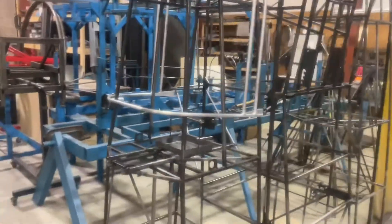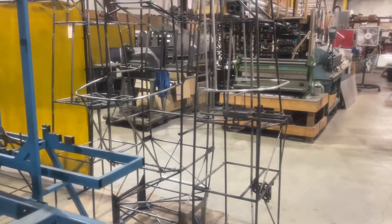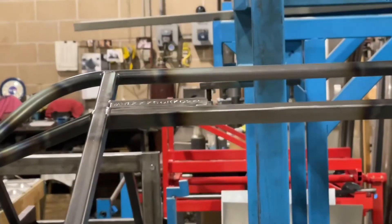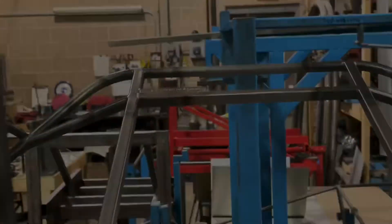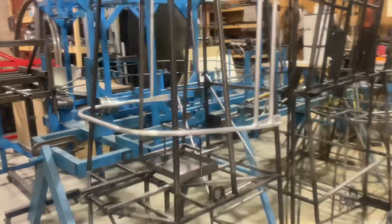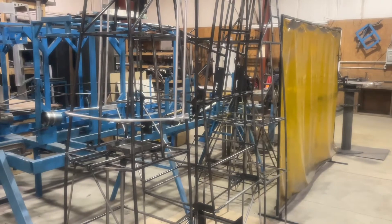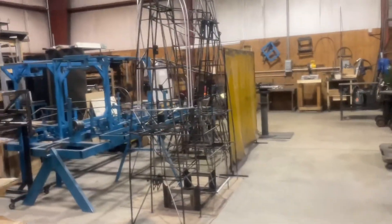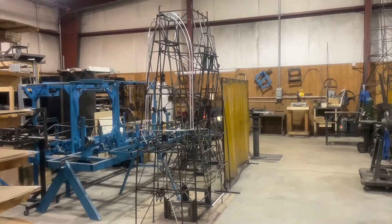For the center section, or the front section, you can see here that's where the windshield area is, and then the front seat and the back seat. The other place where the serial number for the kits and the airplane are located is on the back of the pilot seat right in the front. The frame is a square steel frame and they use hat sections to go around those pieces, and that's what the aluminum skin gets riveted to. So that is the overall frame of the T51.